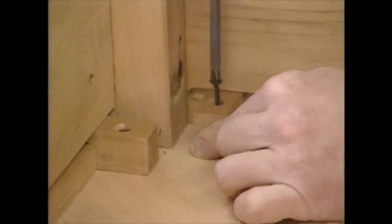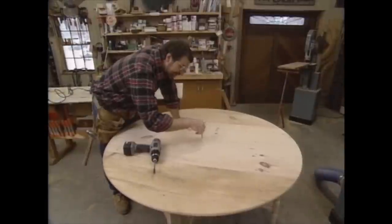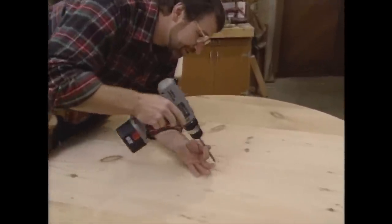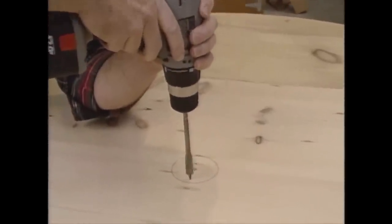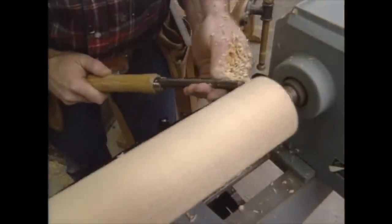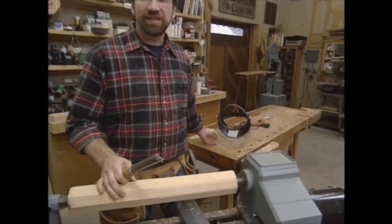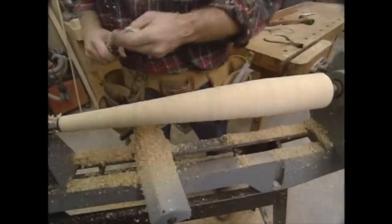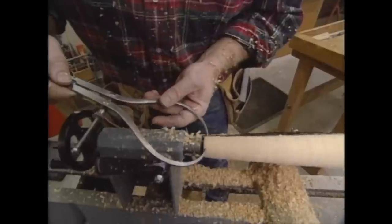This would be a good time to cut the hole in the top for the axle of the turntable. First I'm going to drill a pilot hole with a half-inch spade bit and then finish it up with my jigsaw. Now I'm ready to start making the axle for the turntable. I've mounted a piece of pine in my lathe. I'm going to turn the top four inches to two and fifteen-sixteenths inches in diameter — which is a sixteenth of an inch smaller than the hole I cut in the table top — then taper it down to an inch at the very bottom. The only tool I need is my gouge.